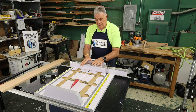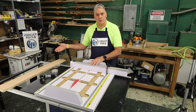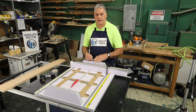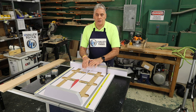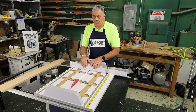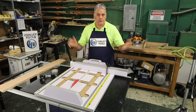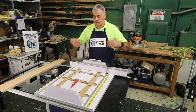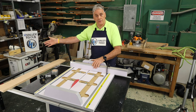That's the basic operation of it for a table saw. But the reason why we called it a multi-form was I wanted to be able to use this on a router table — and that's where it's really cool. On a router table you can do all kinds of cool stuff with angles, different profiles, round nose bits, flutes, and all that kind of stuff. The most important thing is that it's yours — if you feel like you want to put something here, adjust it or modify it, go ahead. I felt too many times these cross cut sleds get too complicated and hard to use. Make it yours, enjoy it. Right now we're going to break this down and hop over to the router table.